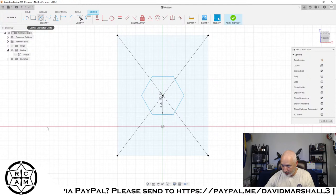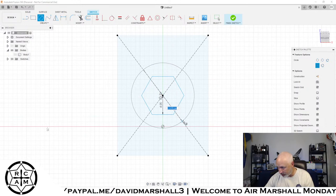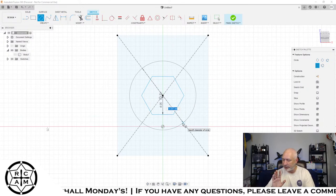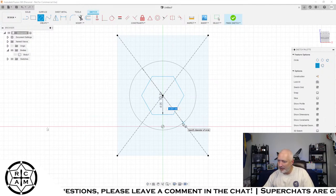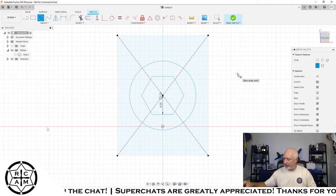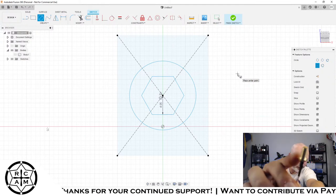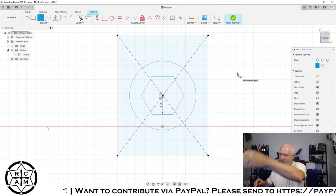So we're going to go right back to that center point and we're going to make a circle that stretches out, let's say about that much over that hex. And that's good. So that'll be the body that holds that hex area in place when the SMA connector goes up in there. So this little piece right here is going to slide up into there, and that hex piece is going to sit into a relief that's created by the two shapes that we just made.